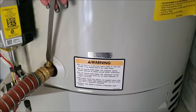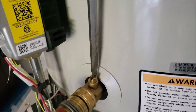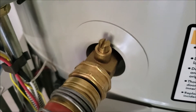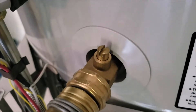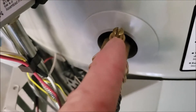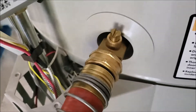It's just a quarter turn — turn that open. Usually when you have a slotted drain valve, most other manufacturers make it a multi-turn valve, so you'd need to go counterclockwise, turn, turn, turn until it's all the way open. With Bradford White, it's a quarter-turn valve. You can see the slot is now in line with the tank, as opposed to perpendicular to the side — so it's draining.